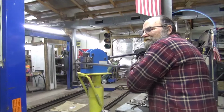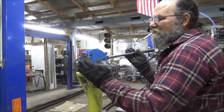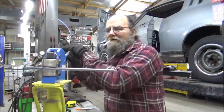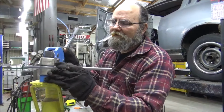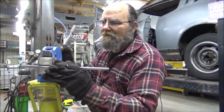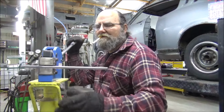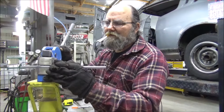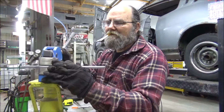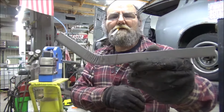Aggressive, I mean, as far as the pressure I'm putting on it and how far I'm moving it. Not moving it that far. See, I'm barely moving that thing, if y'all can see good. Good crank. And just barely move it. And you just keep on like this with the shrinker die. Now I know this is not enough, but that gives y'all an idea of what we're doing.